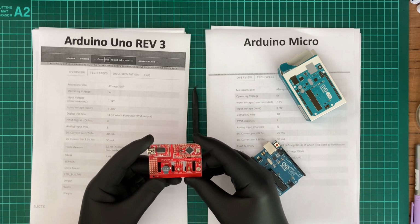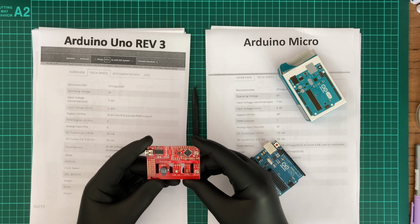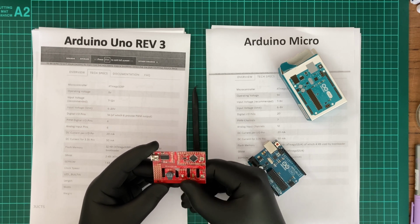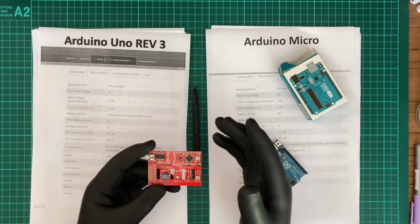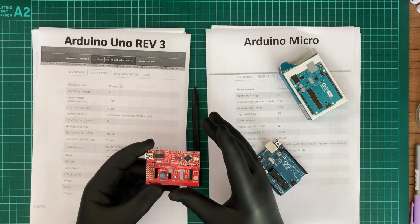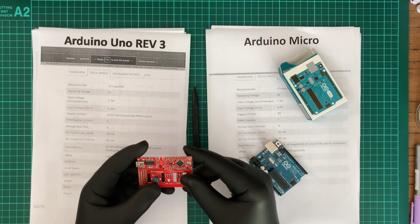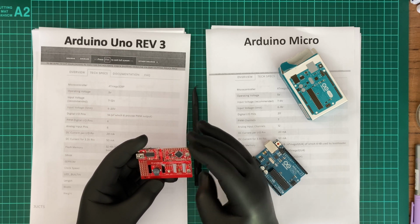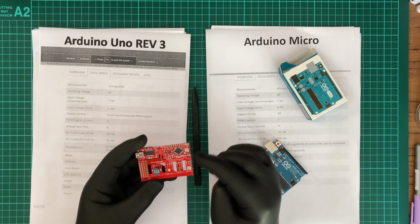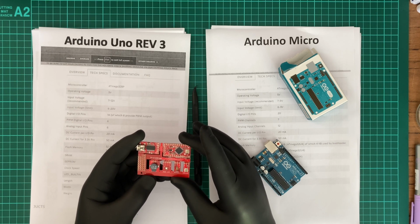Now this Proto Snap, if you're looking at playing for a budget, I think this one was $15, but the price, I don't even know if they're selling these anymore. This has push button, light sensor, RGB LED, and a buzzer. So you can program this thing and everything as it is to play around and learn how to use this damn thing. I mean, even as it is, you could solder in, if you've got those skills, a couple of these headers, and you can start using this for other stuff, except for the ones that are already well utilized, where you can tell with the lines that say, hey, this here is connected to pin 4. It also helps you with programming when you're wanting to experiment.